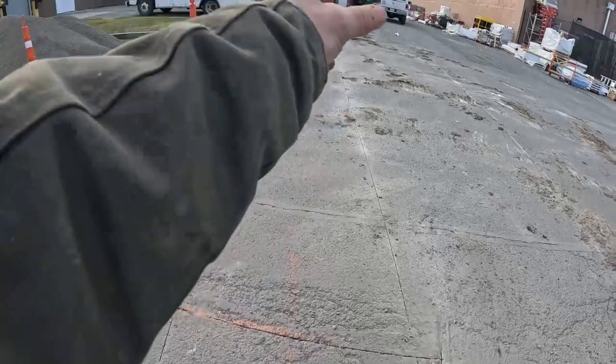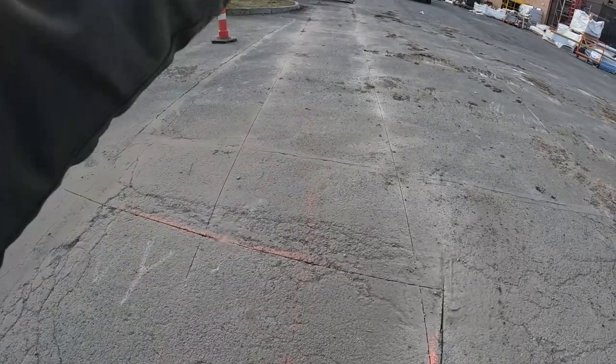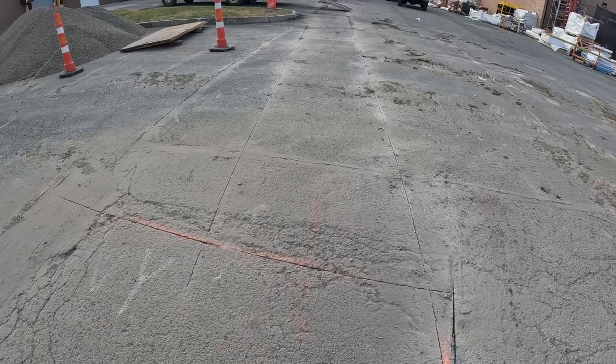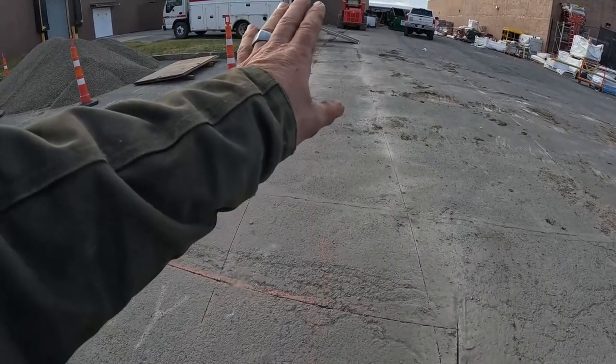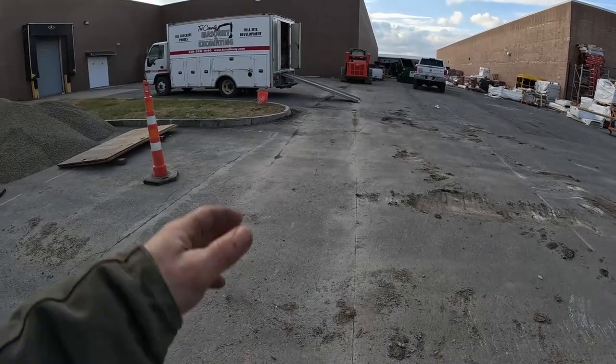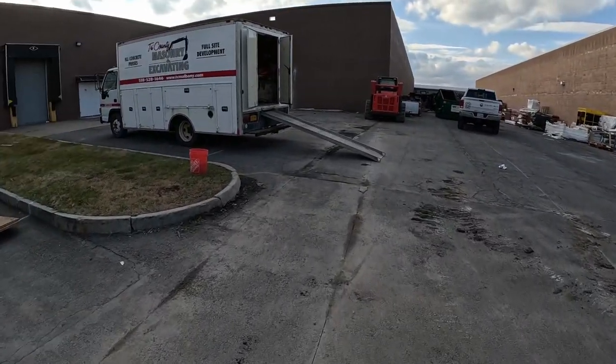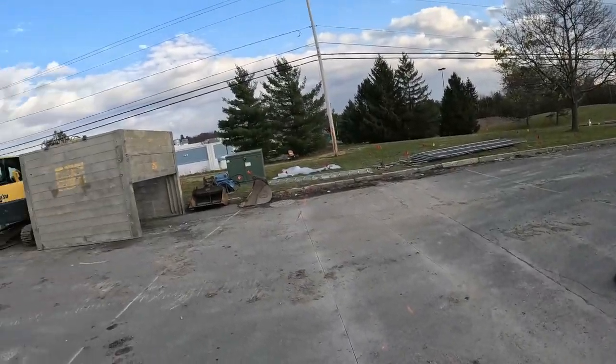Come straight up into this, which will be down 11 feet. And we'll be 6 foot below that water line there. So there's only going to be a 4 foot 45 coming up. And then shoot into the building, and then it will step up to 4 foot all the way, 54 inches to the bottom of the pipe, actually, and make our connection inside. That's the play. That's for Monday.